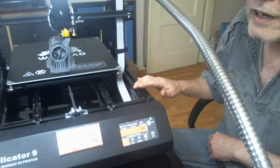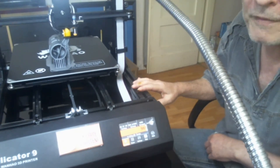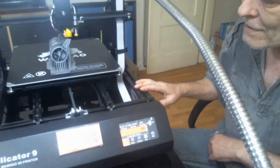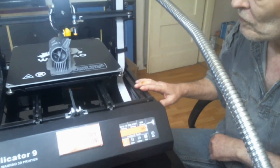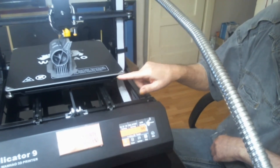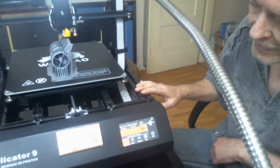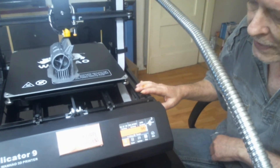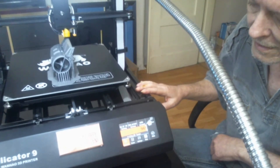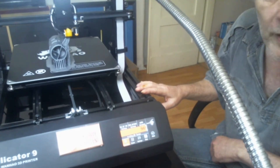They are T-wheels for the T-frame here and not V-wheels. Maybe they are better — who knows. You also have an isolated heated bed, as I mentioned yesterday. After I saw that the bed was only at 40, I set it up to 50. It went up to 50 really fast and it's staying at 50. The nozzle was set at 205 and it stays at 205 the whole time.